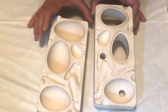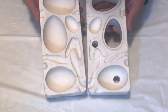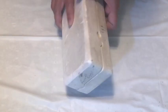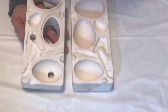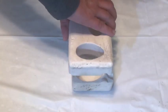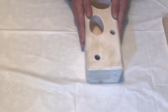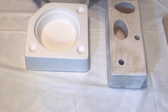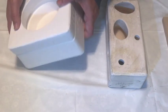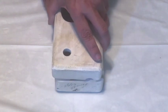In the meantime, I'll take a look at my mold. It's pretty clean — a nice release. One thing I want to mention: look at the keys — these little bumps — and make sure they match up. You never want to put a mold back misaligned and damage the keys. Most molds have an even and odd number of keys, or a cut edge so you know where to place it before putting it together. I have seen molds damaged because they were put back incorrectly, so always make sure it's going to match up and line up before closing.